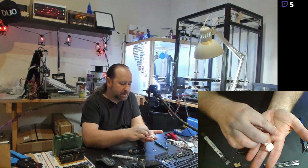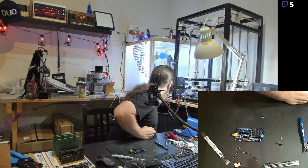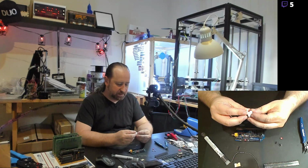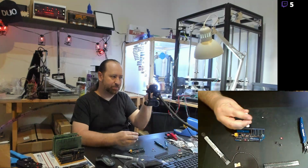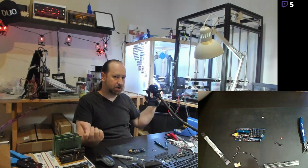I do notice that I am having an issue with some of it sticking to the nozzle. Printer's going through a slow part on the print. When it's been wet, it's been sticking to the nozzle and some of it globs up underneath the nozzle, but it's not really that bad for the most part. If I print slowly without a bunch of super jerky movements or long movements, it has no problem at all.